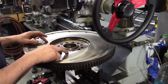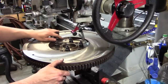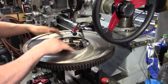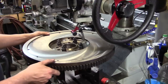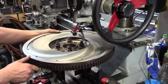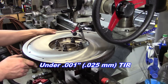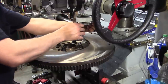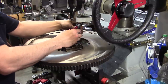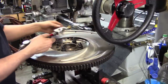I will pause here and do the fiddly bits off camera. I'm using this journal down here as a register — it would have been machined at the same time as this lip and all that other fun stuff inside, so that should be concentric. As I spin this, we're well within a thousandth of an inch of runout all the way around — it's plenty good enough for what we're going to be doing. For a piece of scrap metal I had kicking around, I'm very thankful to have made this.